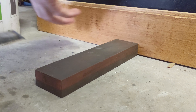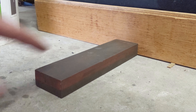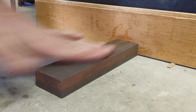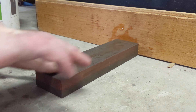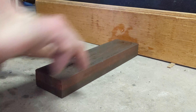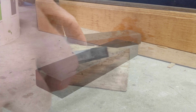I've just moved to the ground here. You want to be somewhere stable — put a bit of wood at the end because when you run along here you don't want to damage the tip of your chisel. Some people put oil on these; I was taught not to. Basically all you need is some water — just wet the block down a bit. Initially, just to get these burrs off, you can run the chisel flat along here.